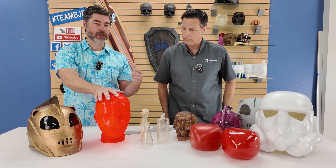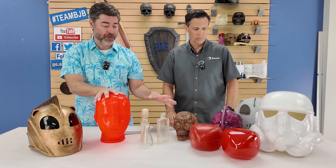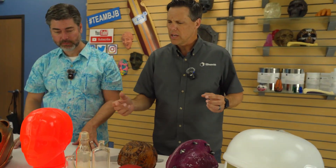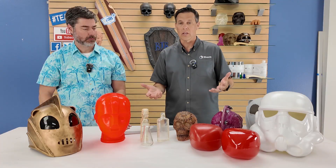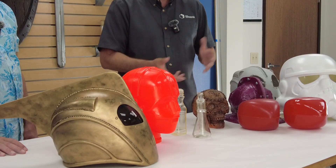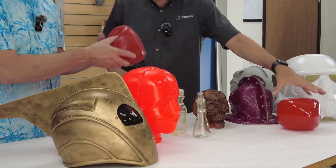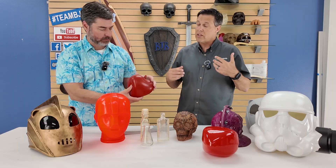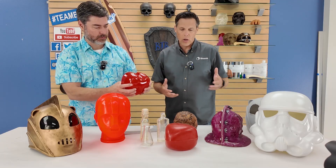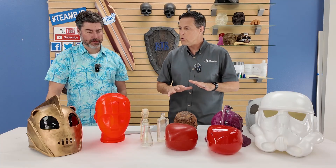We get asked a lot about which resin to use, because some resins are sold specifically as rotocast materials and some are more all-around user-friendly for rotocasting. But the truth is I've experimented across the board. I've rotocast everything from fast-cast type resin systems — for either hand rotocasting or machine rotocasting — to silicones, flexible urethanes at a couple of different durometers, rigid foams, and even silicones. The good news is you can rotocast a lot of different things.